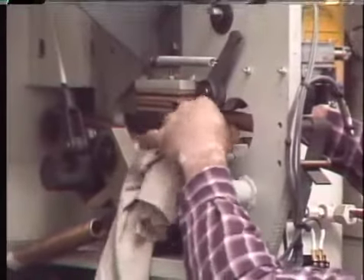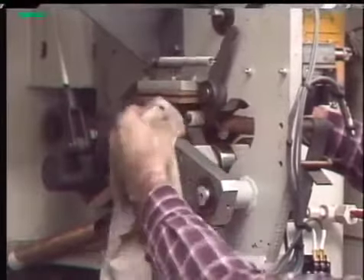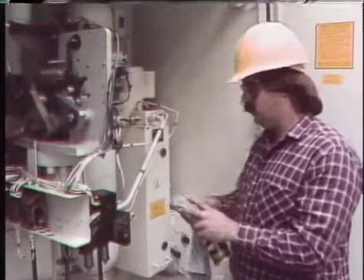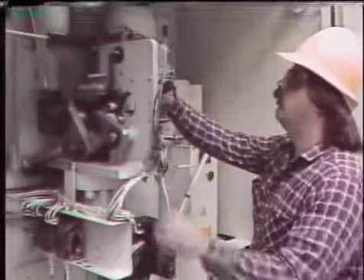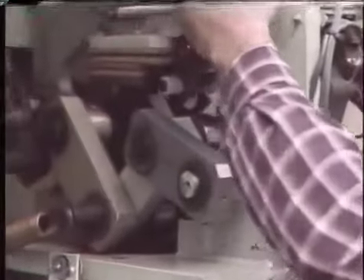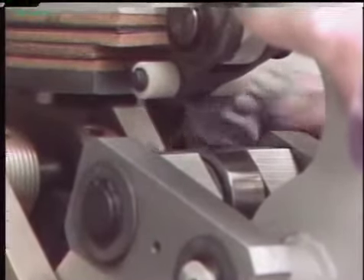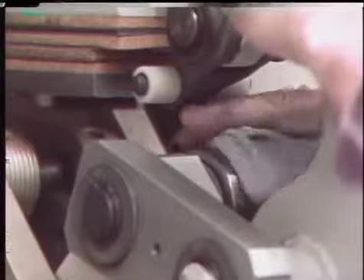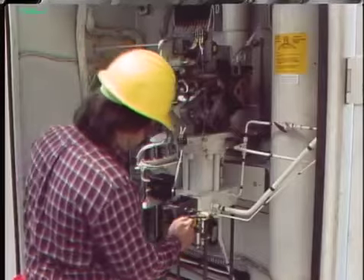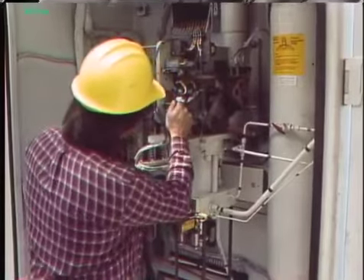It's a good practice to wipe off the links, levers, control coils, latches, rollers, and other mechanism parts. Dirt or rust can be cleaned with a solvent if necessary, and a small amount of rust inhibitor can be applied. While cleaning the mechanisms you can also inspect them — signs of wear may indicate that some lubrication is needed, and parts with excessive wear should be noted for possible replacement. Check for loose nuts, bolts, and screws and tighten any that need tightening.